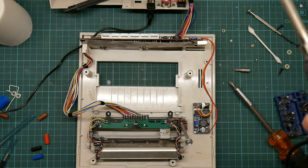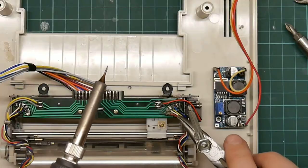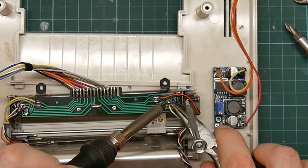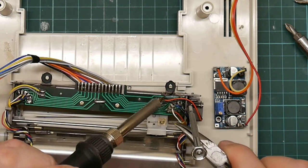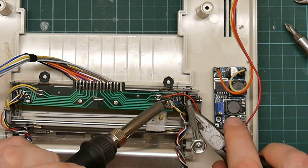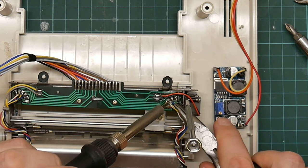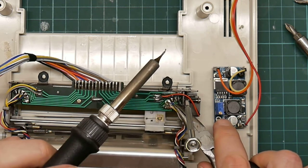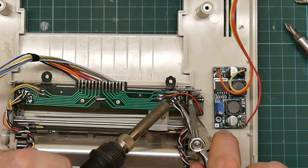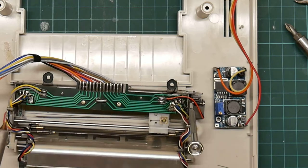So that will keep the wires out of the way. I need my needle nose pliers. Grab the yellow wire. Remove. Interesting, so I made the same mistake on both sides? Well, I copied the wire colour from one side to the other, so I made the mistake on the first side, this one, and then duplicated that on the other. Okay, those are swapped.